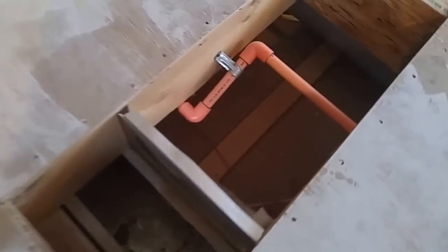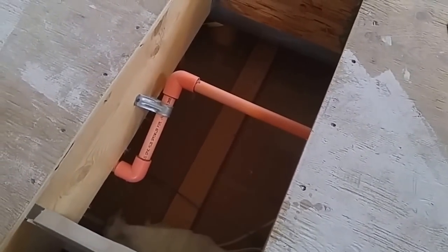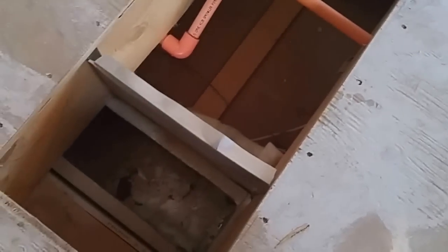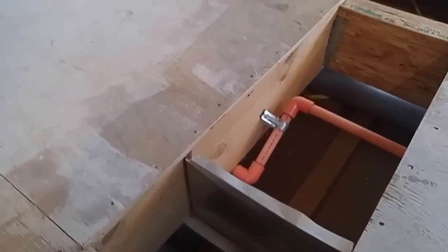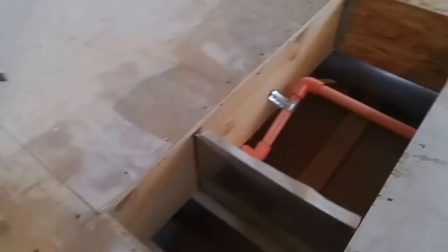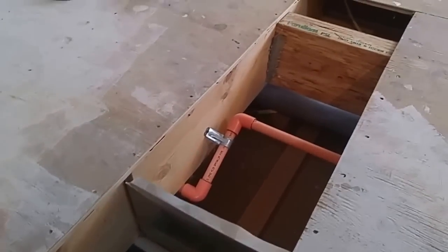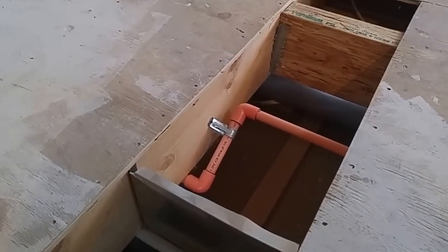The reason is, underneath the floor, you don't really know what's there. There's this metal barrier here. We also got piping for the sprinkler system for downstairs, and then there's a beam going across. You don't want to be cutting really deep into beams, you don't want to be cutting too deep and hitting your sprinkler line, and you don't want to be cutting through anything else like barriers or wiring and stuff like that. So it's really important to set your depth correctly and try to do as minimal of a cut as possible. If you cut through once and you realize you're just not deep enough, that's okay. Set your saw, cut it again. It's better to do that twice than go too deep and then hit something and cause huge damage or big headaches for yourself.